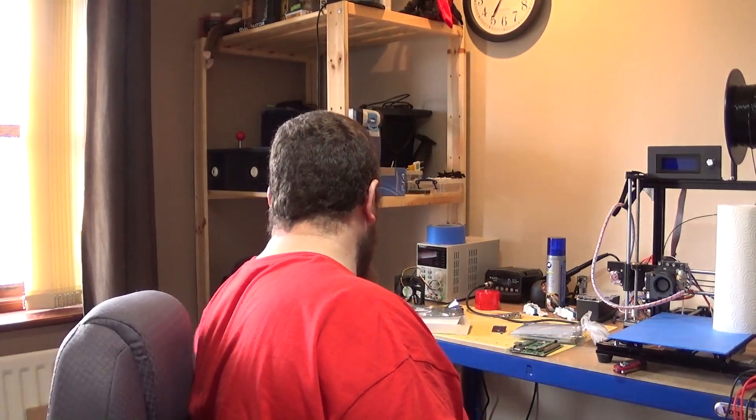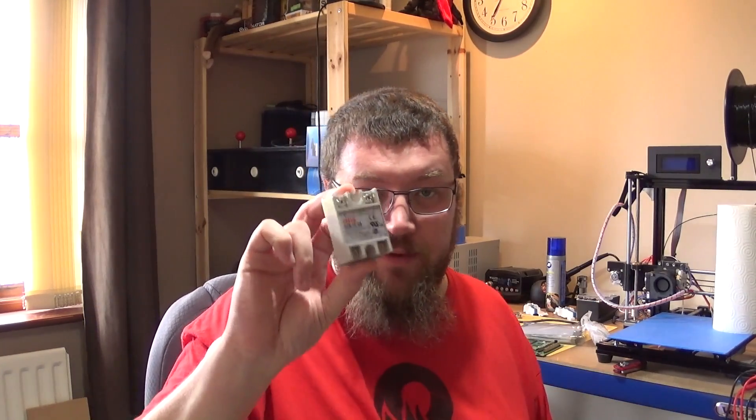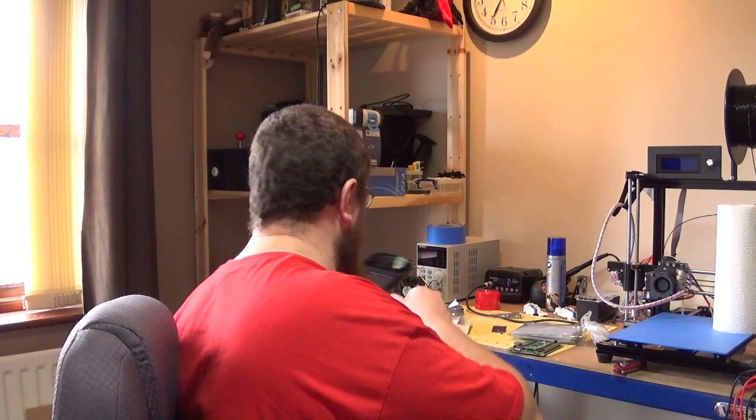To do that I'm going to need to do a lot of surface mount work, because of the size constraints. To take this project any further, I need to build myself a reflow oven and have it solder the mounts for the flat flex connector, because I just cannot do that myself. Point one inch through hole — no problem at all. Larger surface mount I could probably do by hand as well, but for the really small stuff I have to get my reflow oven up and running.